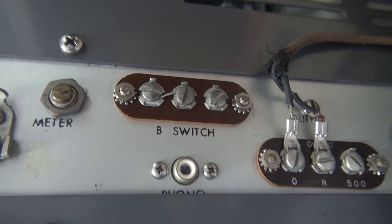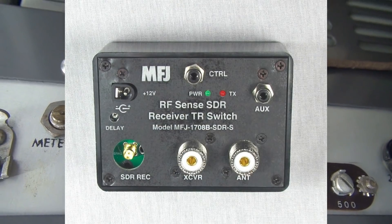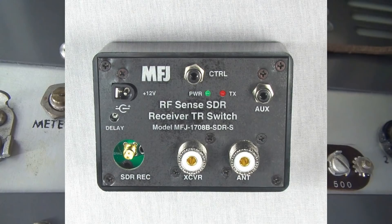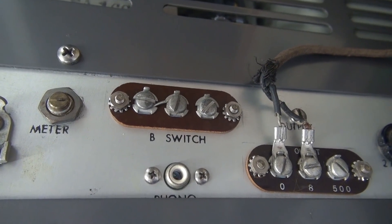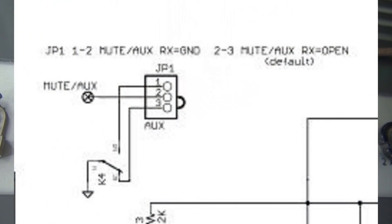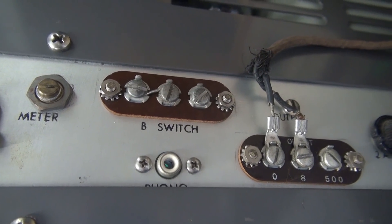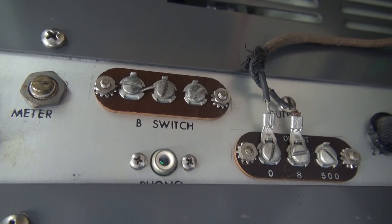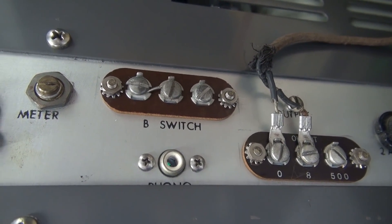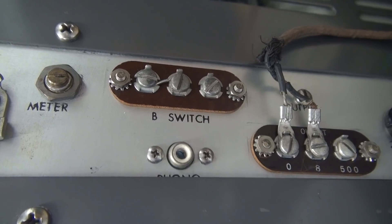Back to that phono input plug — you see that's an RCA. Now, MFJ makes the model 1708B TR switch, and that's kind of the modern one available on the market. But the problem with the MFJ is, if you take a look at this diagram, the internal K4 relay, which is their mute relay, only switches to ground. So if you had one of these vintage receivers and you had 300 volts on the terminals and you grounded it, I bet you'd blow up the MFJ unit. So with the new K1S relay, you can use these new MFJ TR switches with no problem.